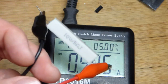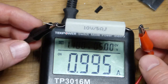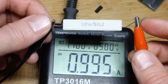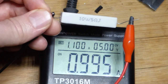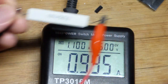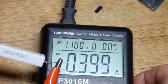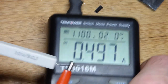Not very complicated, but it is an important thing to understand when you are building circuits. It is mostly the current that becomes a problem when it comes to wattage. As you need more current flowing through stuff, things tend to start overheating — usually you also need more voltage to get that accomplished. Sometimes you have a relatively high voltage but it doesn't really need any current, so the wattage isn't that high.